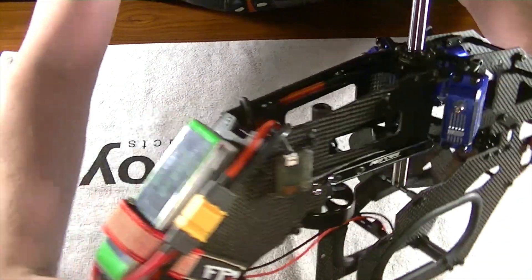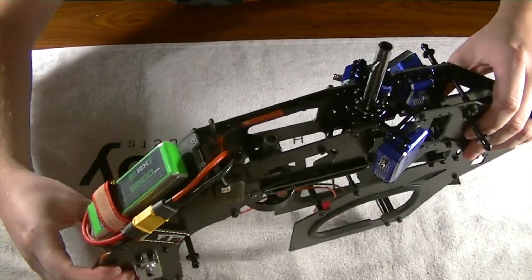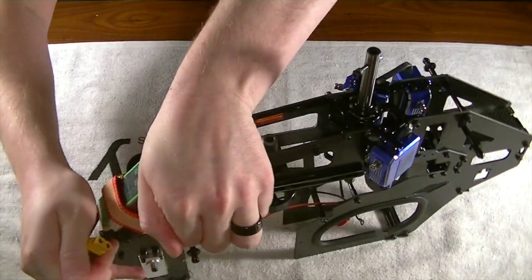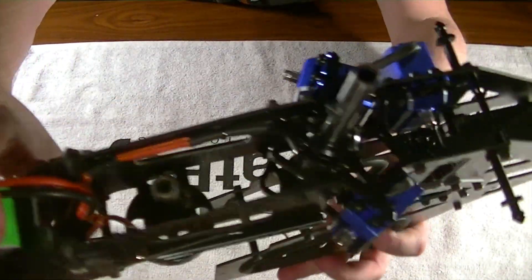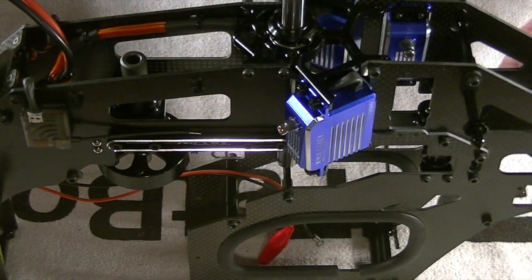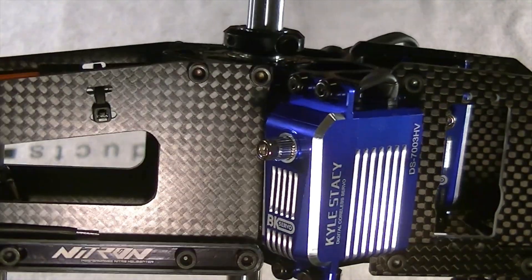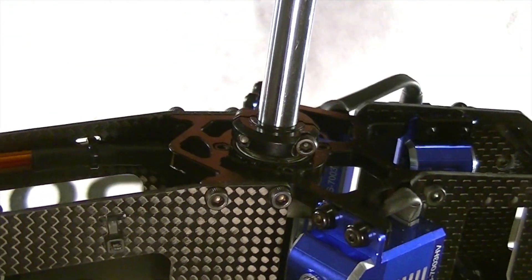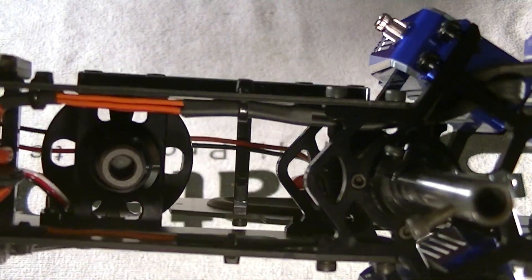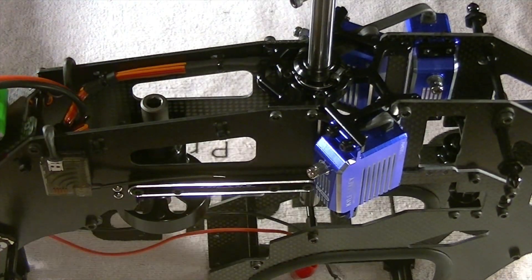That's the wire schematics for the Nitron — that's how I decided to do it. Let me take a quick look at how I did my servos. What I did with the heat shrink is I tucked them right underneath. If you get the heat shrink hot, you can manipulate and bend it to the desired fit. Inside I also added heat shrink — take in mind you gotta take the connectors off the servo in order to do this, but it's really easy to do. I've got videos on this. Then double zip ties there on each side, and everything routed right down.